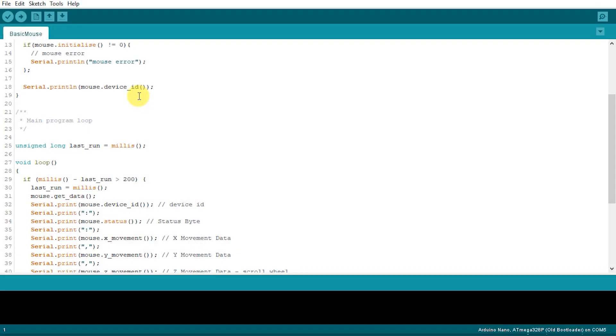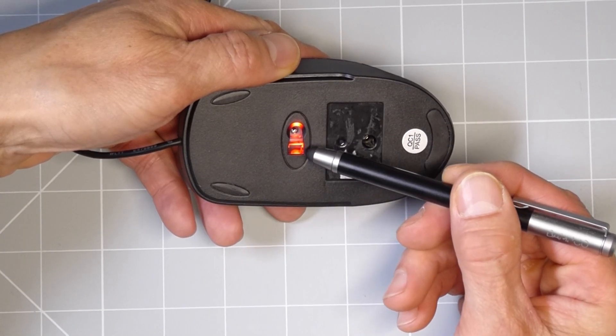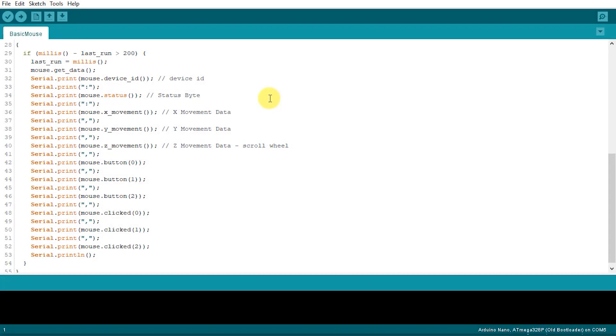At this point in our sketch the mouse should be up and running, and you can confirm this by watching the LED turning on beneath the mouse. If that LED does not turn on, it means the mouse hasn't been initialised correctly and you probably won't get any data from it. To read the mouse, you need to call the getData method. As the mouse moves, it stores movement data until you ask it to send the data across. Once it sends that data, it resets all of its movement counters and then resumes measurement. So the movement data we receive is always the distance moved since our last read command.